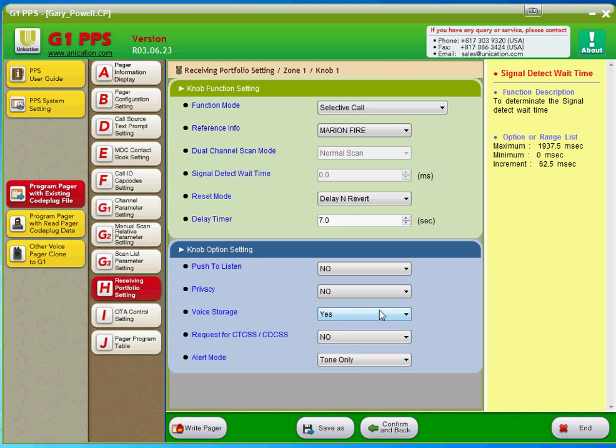Now this request for CTCSS or CDCSS: if you have specified a PL tone or DPL tone in the programming software up here under channel parameter settings, you would be able to enable this particular knob setting to use the PL tone or the DPL tone. In our case, our channels are not using any PL or DPL tone, so we're going to leave this off.